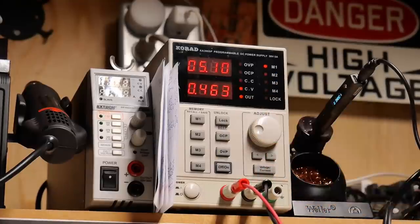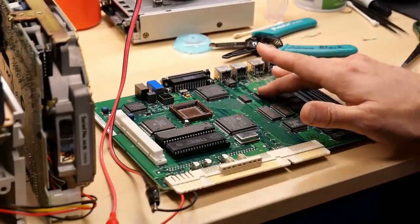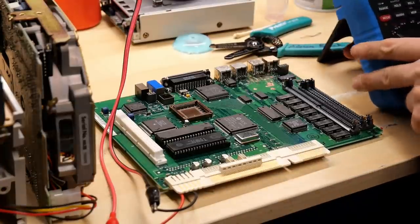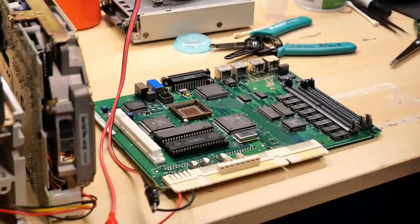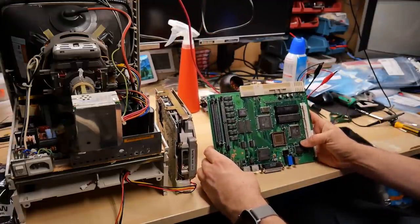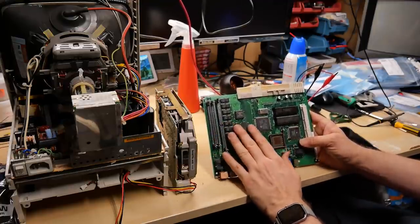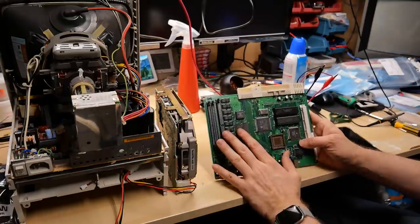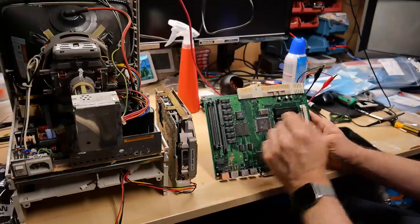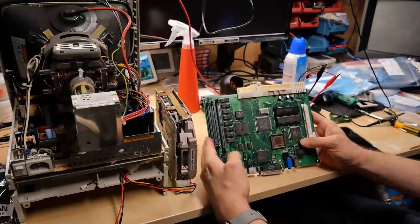Let's just turn it up a little bit here. Okay, 465, 463 milliamps — sort of stable. There's no smoke coming out of this board at all. Let's just check the chips here. Still drawing 450 milliamps. Everything seems okay. I'm just going to quickly double check to make sure that I am seeing five volts — 4.98, good, that looks nice. I've been poking around this motherboard and yeah, it doesn't seem to have any signs of life. With the five volts running into it like it is right now, the chips get a little bit warm but really nothing out of the ordinary. It's probably been running for 10 minutes. The processor and this VLSI chip are a little warm. The crystal oscillator is running at the correct frequency, but checking the address and data lines on the ROM chips, nothing's happening at all. Some of them are high and some are low, but there's no code execution. So this board is definitely not running right now.